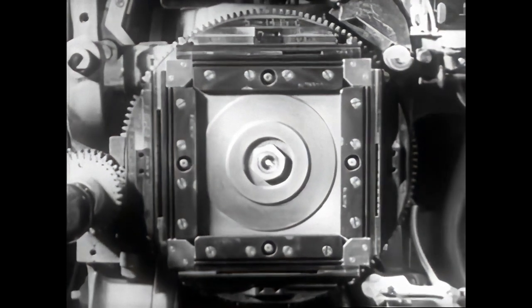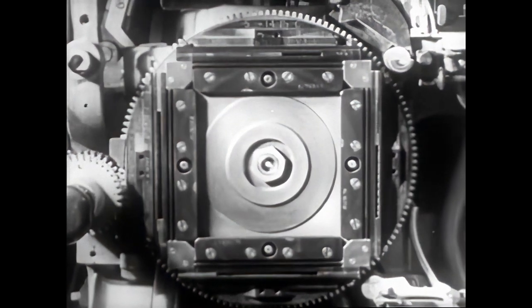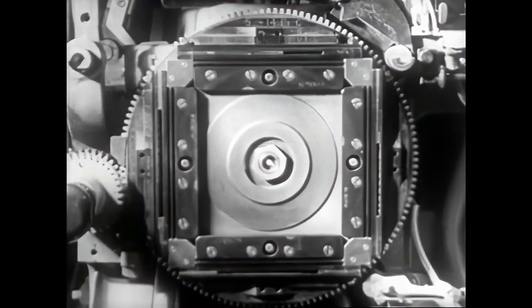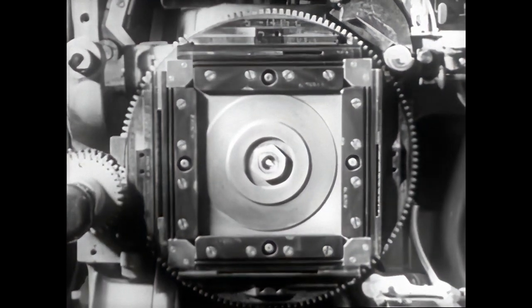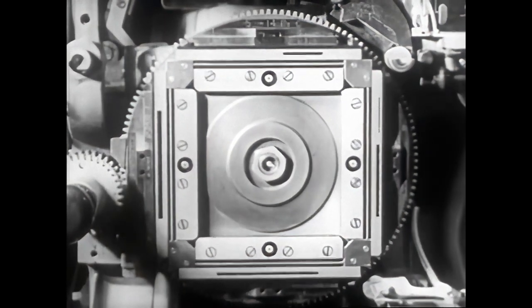The mold is mounted on a rotating disc. The disc has teeth which are geared to a pinion activated by two sections of gears so that it rotates at intervals. Normally, the wheel carries four molds for casting.